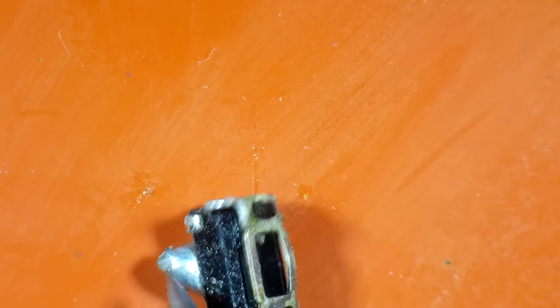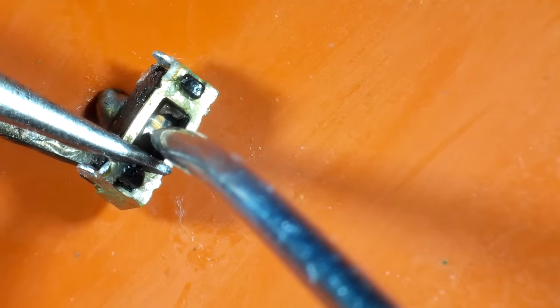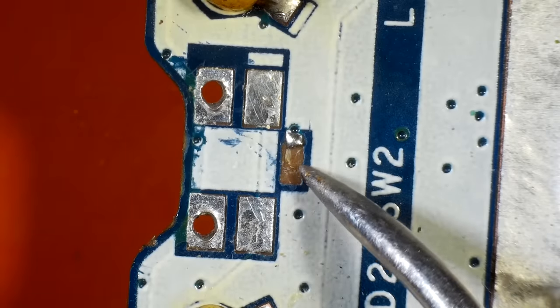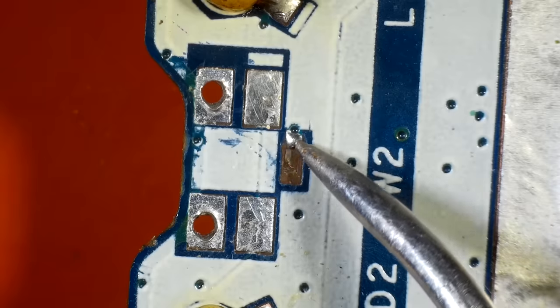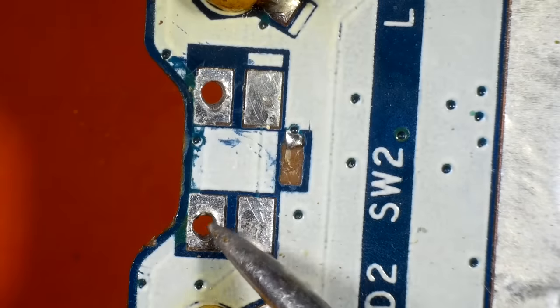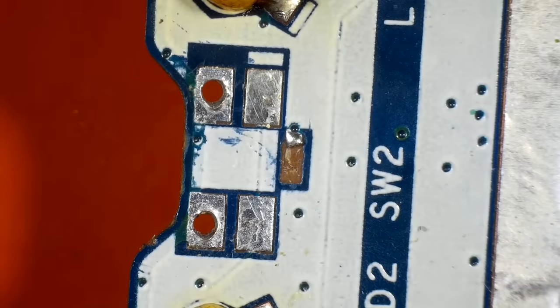On the front side you can see how it's broken — there's supposed to be a plastic piece poking out, and this right back here is the actual button. You can see when I press on it, it moves in. That's the old one, and this is the new one — that is what it's supposed to look like. Now looking at the board, we can see that a mounting pad has been torn off — it's a grounded mounting pad. I think we're still going to be able to mount this on nice and tight with just these two pins, and we'll try to connect it back here as well to make sure it's soldered on very solidly.